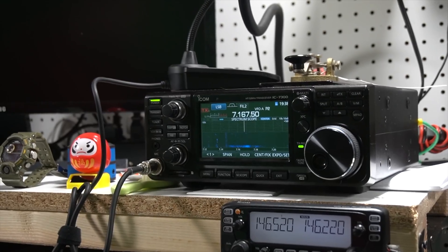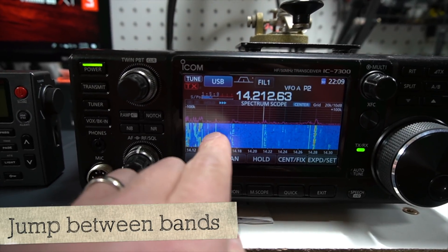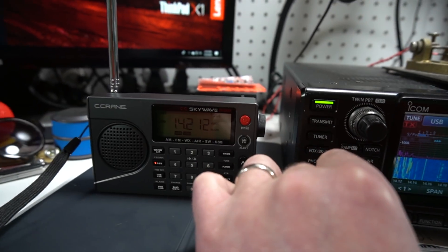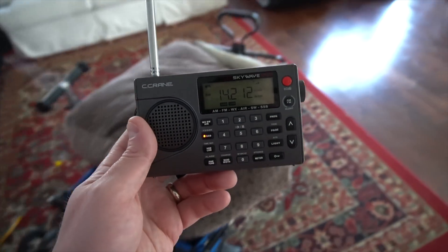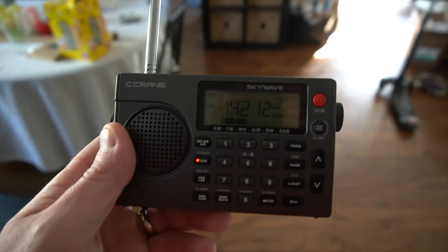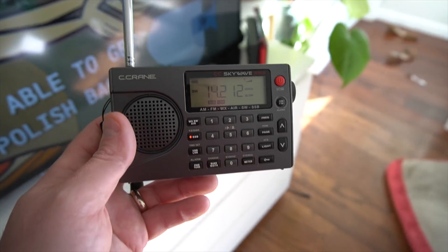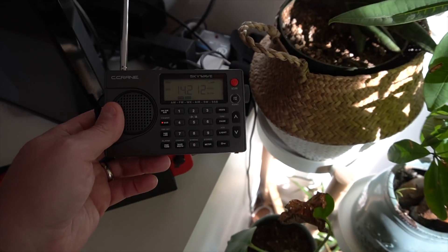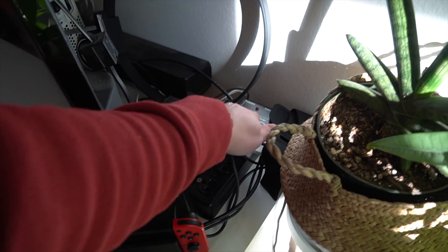So it's something in my computer system that I set up recently. We've got this drumming sound — boo-boo-boo-boo — it's right here and it's repeated. I've got it on my shortwave, and this is only going to pick up the local interference. There's like a tone to it, so this should be easy to find if we just walk around the house. Three bars... it's getting more pronounced — four bars. Now it's totally easy to hear. It's the TV! Let's see what happens when we turn it off. Gone.